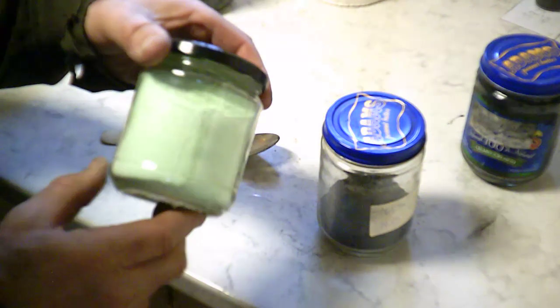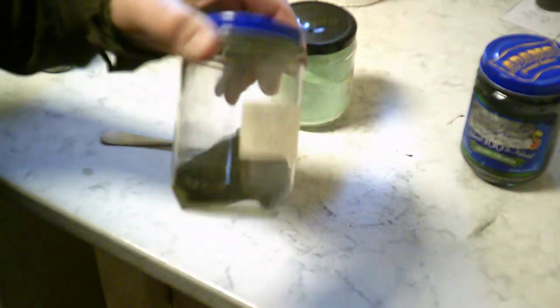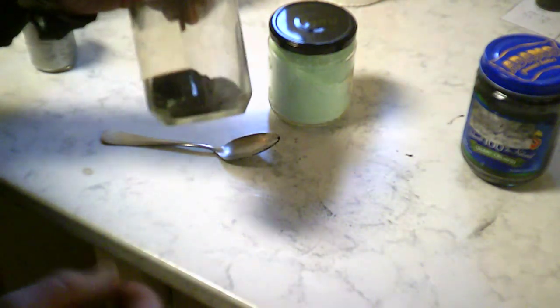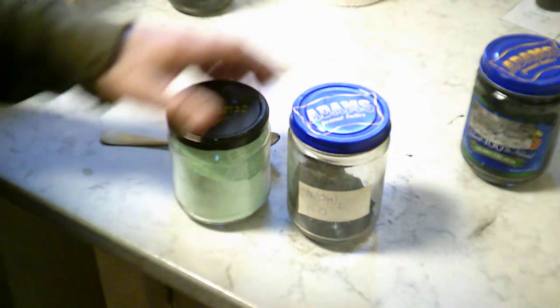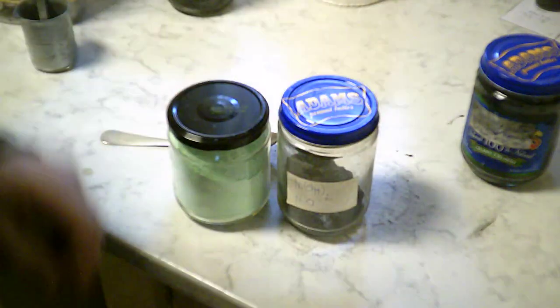When I first started trying to make batteries I bought a big five-gallon pail of nickel hydroxide - the fluffy green stuff. I'm thinking: why start with that? You can heat it up to over 300 degrees Celsius, up to 500, and turn it into nickel oxide, a black powder. It's more dense and lower molecular weight, and it might work better in the acetone and give more - and it'll turn back into nickel hydroxide when it hits the electrolyte in the battery cell anyway. I'm asking myself why I didn't just start with a bag of nickel oxide from the pottery supply store.